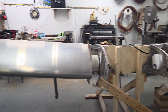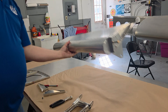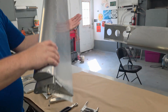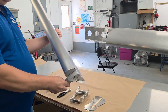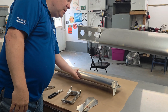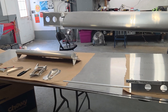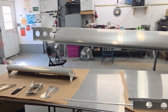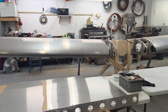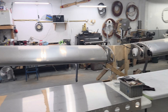Here's one of the flaps — pretty simple construction, doesn't weigh much but really, really strong. It's the airfoil shape with brackets, and all the brackets have bronze bushings so it should never wear out. The top skins are just off so I can get into the rest of it. Pretty much all that's left for the wing at this point is getting the ailerons into the bell cranks, then closing it up with a few access panels — and the wing will be pretty much ready to go in the airplane.